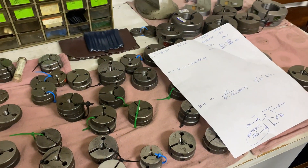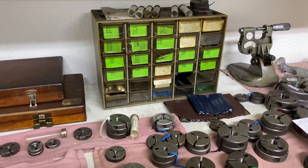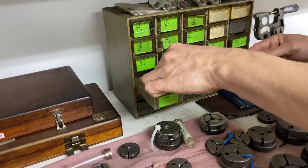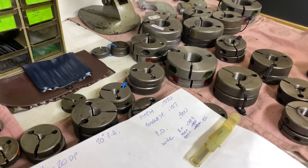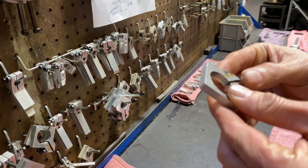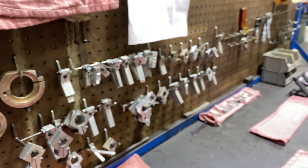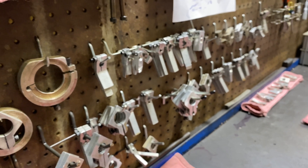When they're cutting threads, here are all the thread checkers. Over in their metrology department, what we're after is some pins. The thread we're going to grind — or worm form actually — with our diametral pitch is something you need to measure over wires with measurement over wires. The whole design and part drawing is delivered in advance so these things can be calculated out. After you get the pins, you need to get a dog that fits your part. Luke's workstation is just wonderful — they've got a dog for everything and everything's in its place.